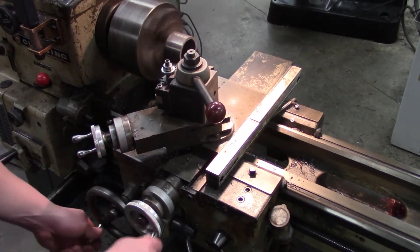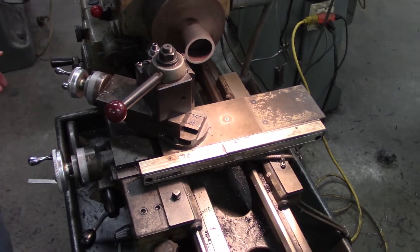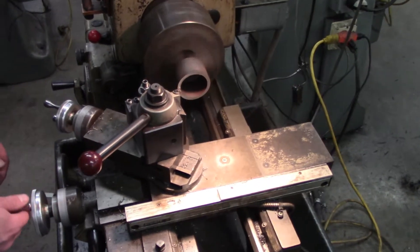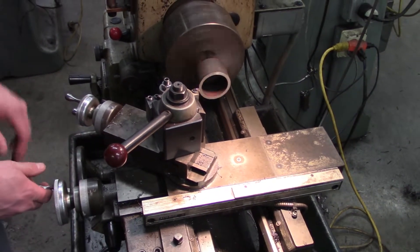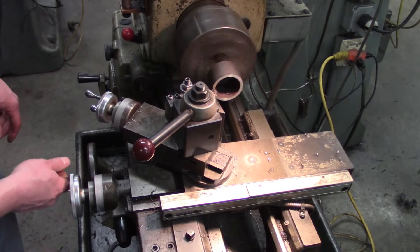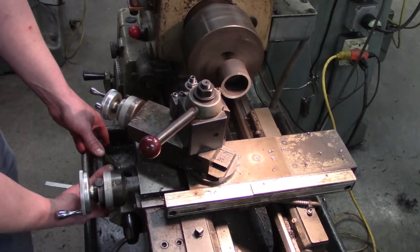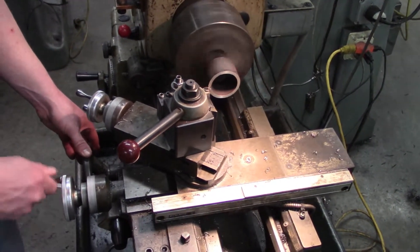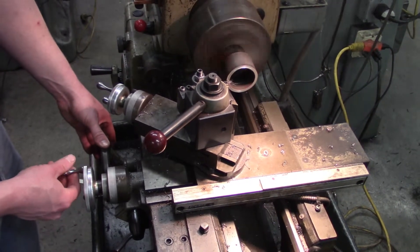You're going to use the big handle to get you close, then closer with the medium-sized one. Add some oil to it. You want to barely touch it on your first pass. Move the big one over just a little bit — in welder's talk, less than a sixteenth of an inch over. Keep doing this until you get a steady stream of chips coming off. That way you know it's perfectly flat. A perfect steady stream of chips coming off — you're good to go.